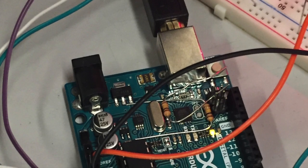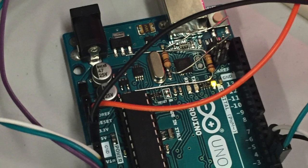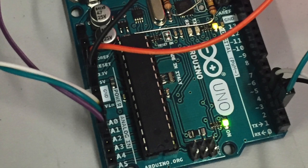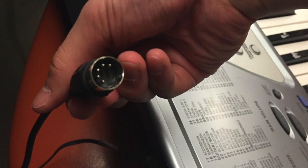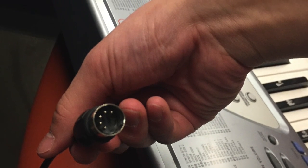Now the Arduino is programmed to say, whenever this threshold value is crossed, send in the signal. For example, if laser beam 2 is blocked with your finger, like you pluck the string, then the command to play note D will be sent from the Arduino to the speaker, which in our case is the keyboard.